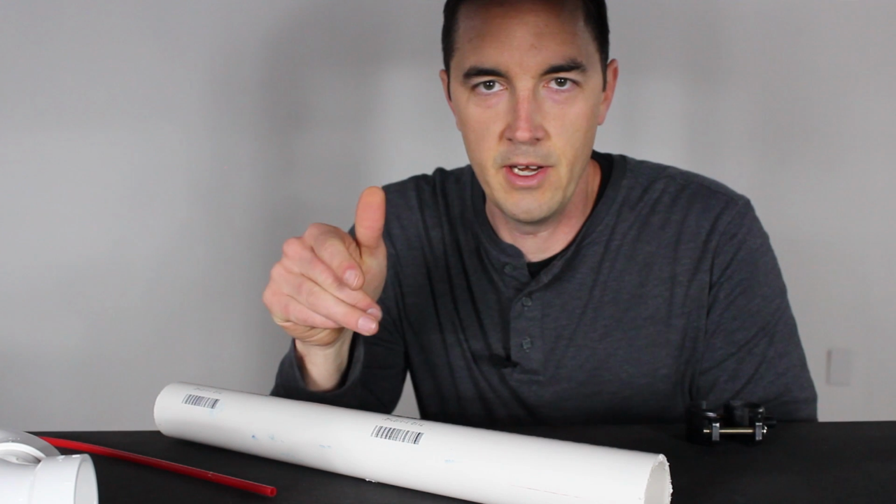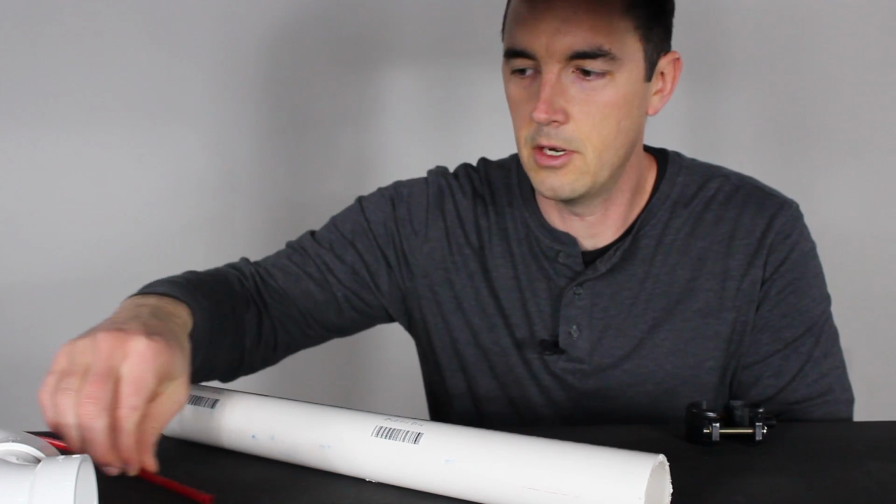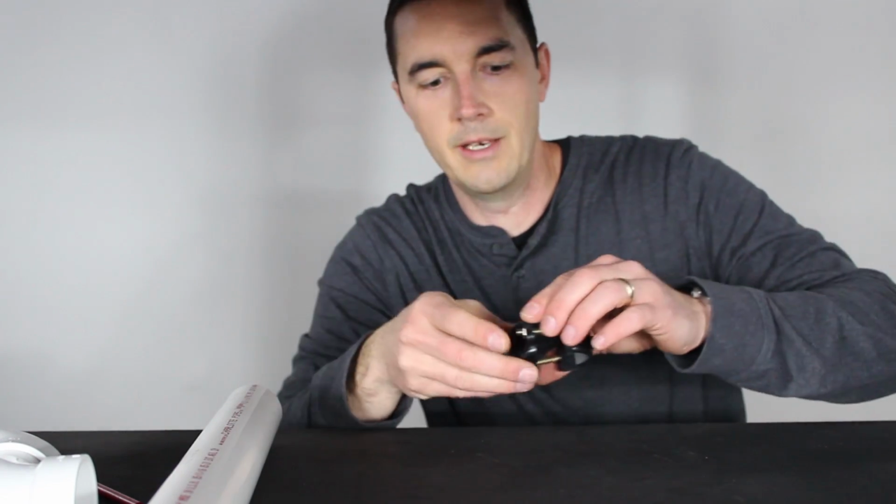Okay, so the last fitting we have to put in underneath the sink here is called the drain saddle. This is going to be the line where the wastewater from your RO system runs out and into the drain of your sink and out of the home. Typically, for every gallon or so of water that's made by an RO system, you're going to lose 2 to 3 gallons of water out of the house.